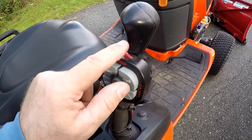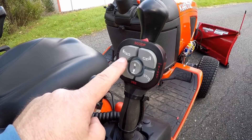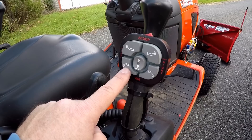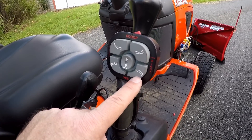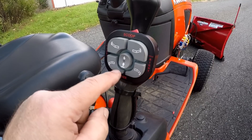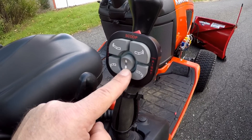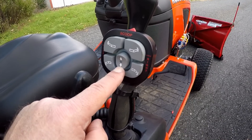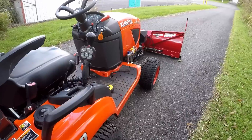The hand control has five buttons. Top left moves the left blade forward; bottom left moves the left blade backward. Top right moves the right blade forward; bottom right moves the right blade backward. The arrow up will raise the plow; the arrow down will lower the plow. Pressing down will not put pressure on the blade — it will basically be in the float position.